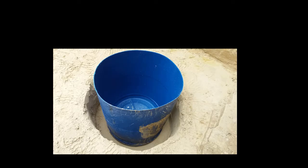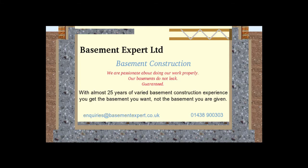Basement slabs usually have a sump. You can almost as easily set the rods to create a shallow fall to a sump as set them level. If you do, the job will always drain and there won't be any puddles. Later, the client will save by not having a gully round the edge, by not needing a wasted screed, and he will get more headroom as a result. The subcontractor can save money and the client can get more space.